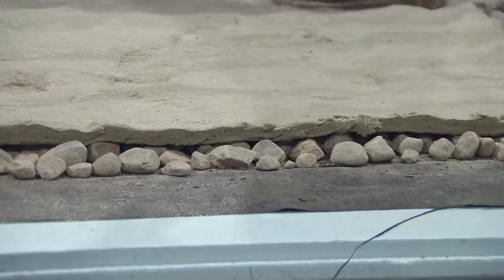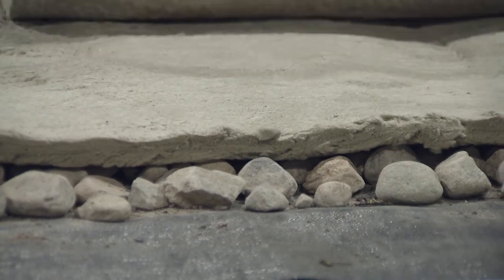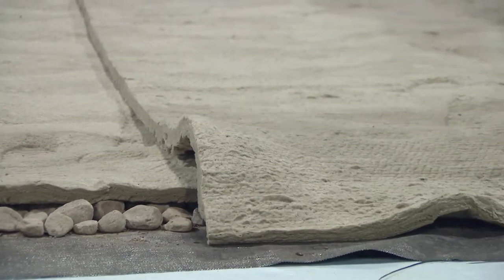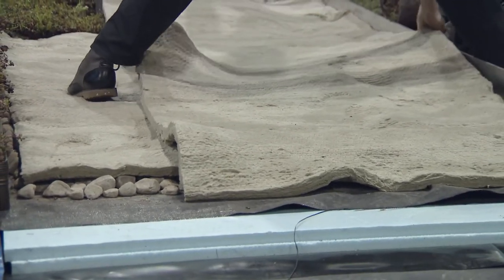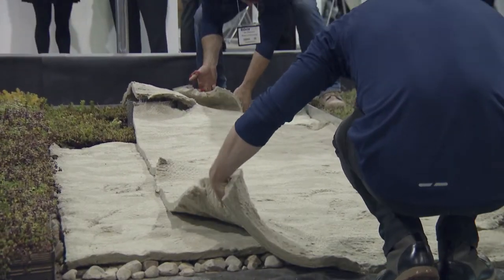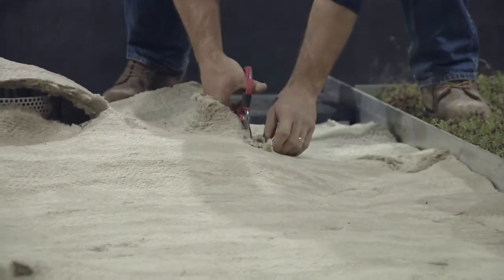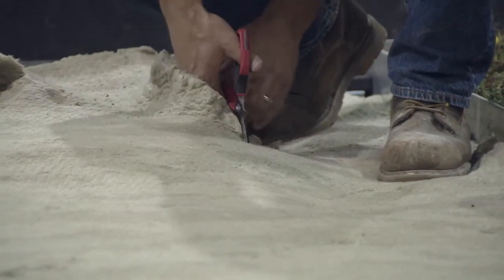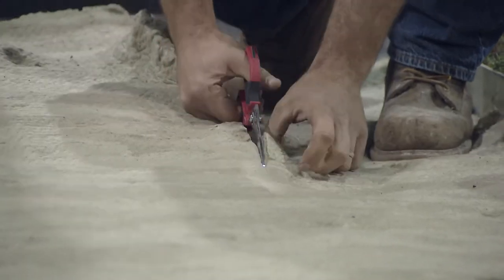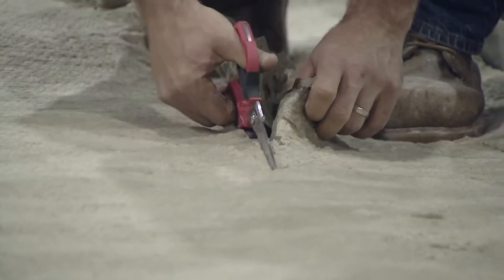The main function of this one-inch needled mineral wool is to retain water and nutrients, which will be accessed by the plants as the roots grow into this layer. It's quite efficient at retaining water — more so than growing medium on a per-unit weight basis. The needled mineral wool can retain 25 litres of water per square metre, which is almost triple the amount retained by one inch of growing medium, yet saturated mineral wool is still about 10% lighter than growing medium. Additional water retention layers — such as a fleece component or two layers of mineral wool — can also be incorporated.